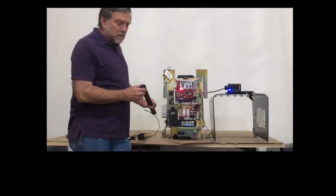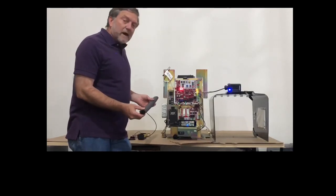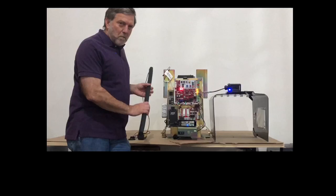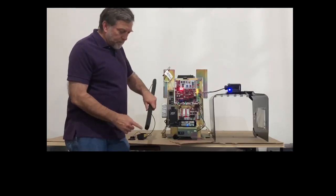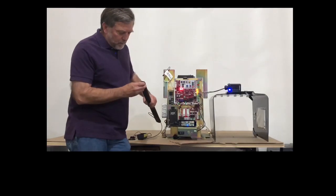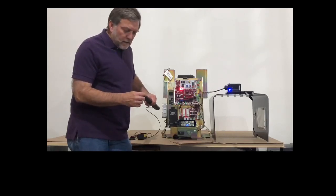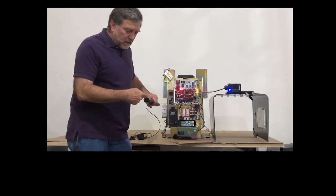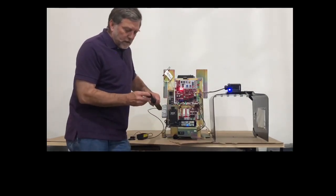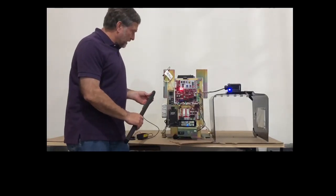The first step is going to be making sure we have the rubber safety edge's end caps properly installed on it, so that it is sending a signal to the board that this is in fact a monitored device. So on the bottom of your monitored edge, you will have a hard plastic end cap. It's a two-piece hard plastic, a larger piece, and then a smaller one that has two steel pins that must pierce into the wire that's running the length. There's two wires that run the length of this rubber edge, and when this bottom plug is installed properly, that's what gives it its continuity to send the signal.